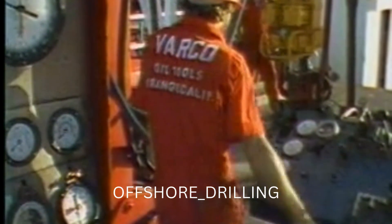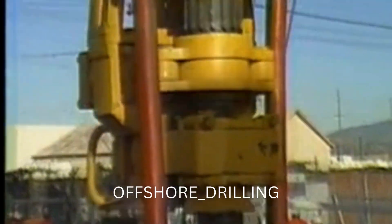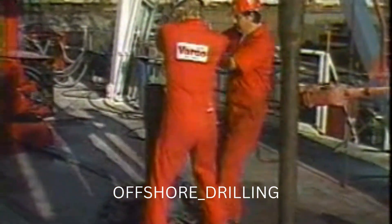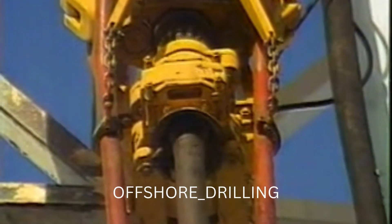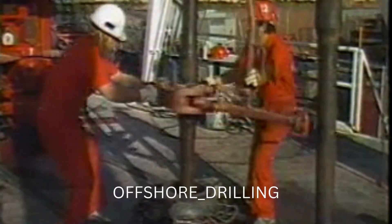When a stand has been drilled down, the driller stops rotation and sets the slip. He then initiates the hydraulic pipe handler's breakout sequence. The torque wrench elevates to engage the spline on the drilling shaft. The lower jaw clamps the box and the connection is rotated 30 degrees to break. Next, the driller reverses the drilling motor to spin out of the string and hoists the system back to the monkey board where the derrickman drops in the next stand. The new stand is hoisted and stabbed into the string and the driller slacks off to stab the drilling shaft into the upper box. Both connections are spun up and torqued by the drilling motor with a single tong holding back up at the floor. When the driller pulls the slips and starts the pumps and begins rotation, the system is making hole again.